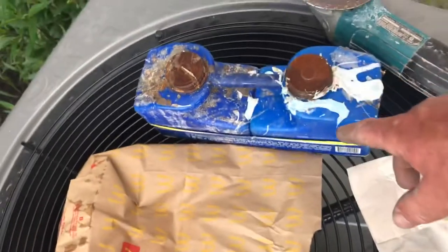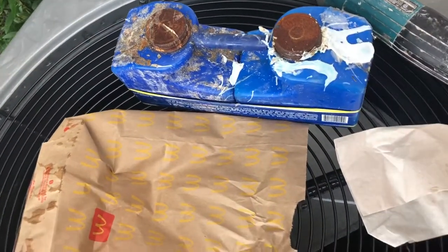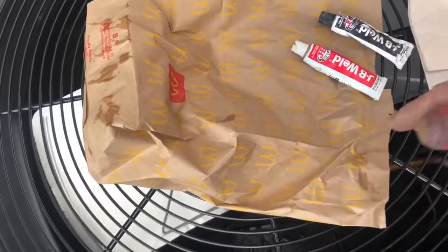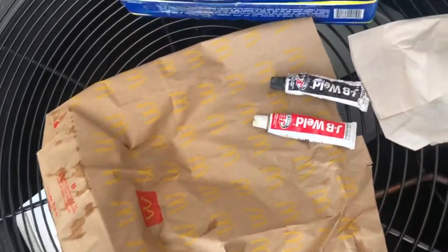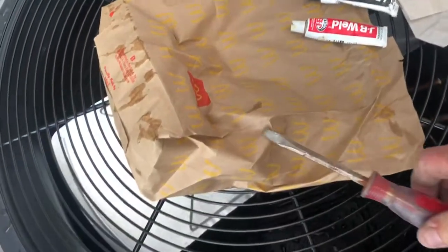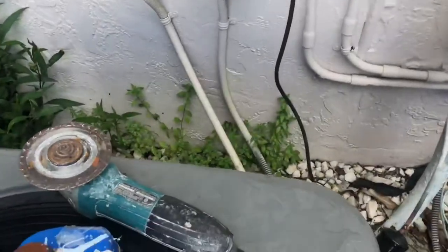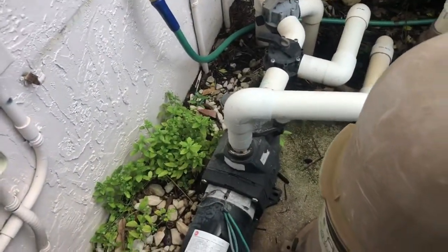A little napkin. I've got my glue caddy here, where we're going to be using the cleaner from the caddy, and something to do the two-part mixture of the compound together. Anything is good, just so you have a mixing platform. And then maybe a flathead or some type of spatula to put it on there. A lot of times, when I have it with me, I use 80 grit sandpaper to scuff up the area. Other times I use my grinder with a Makita circular saw blade, and I just grind the area very lightly. So that's what we're going to be using today.